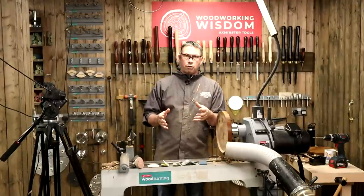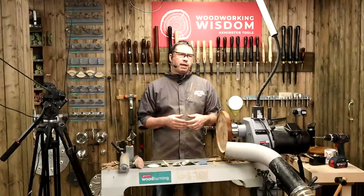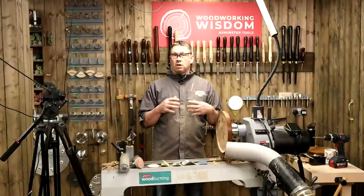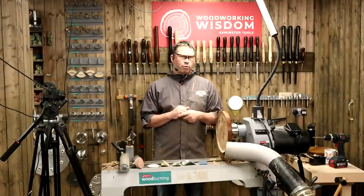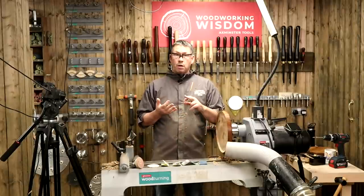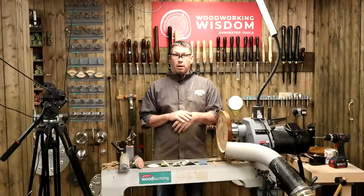I would guess most of your projects are going to be fairly small. So you've got a choice there. I would probably go over oil, instead of oil, I'd probably go your sanding sealer wax route because you want a slightly higher shine on that type of project if they tend to be smaller. Or buff with buffing wheels, Tripoli buff or carnauba wax would be the way I go.